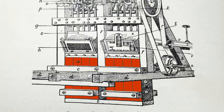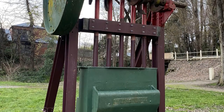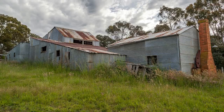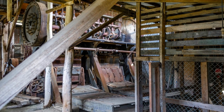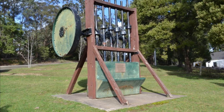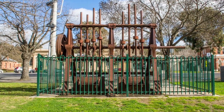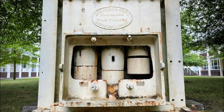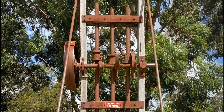Each set of mortar blocks supported one mortar box. Although 5 heads of stamps per mortar box is typical, they were also made in sets of 4 or 6. The stamp battery housed within this shed at Tarradale has a 4 head and a 5 head battery set alongside one another within the same framework. This battery on display at Blackwood has a set of 6 stamps. This one on display in Heathcote has two sets of 4. There were also smaller stamp batteries with 1 to 3 stamps, but their foundations and framework would typically be less substantial.